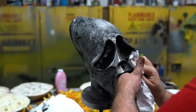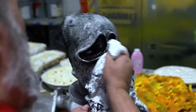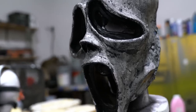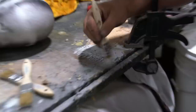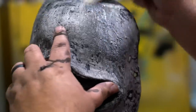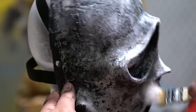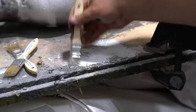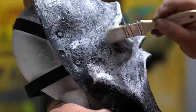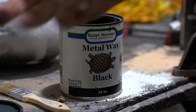I really like that distressing — I think that looks really nice. I'm going to grab a little more white and punch up its whiteness in some areas, and then I'm going to hit this with a little bit of black wax. I want to scrub the color on. I don't think this turned out white enough. It's very textured and heavy, and I don't hate that. This is a wax that I use a lot from Sculpt Nouveau — I buy it from Biddy Mold Supply.